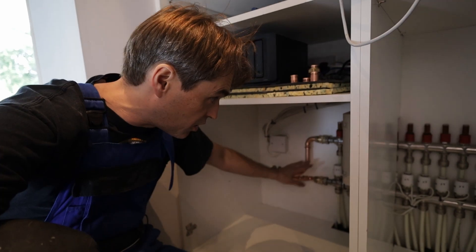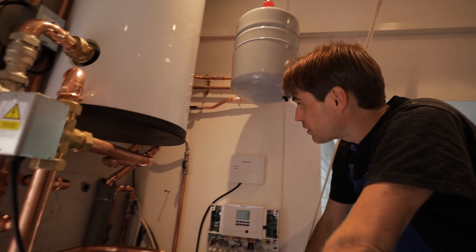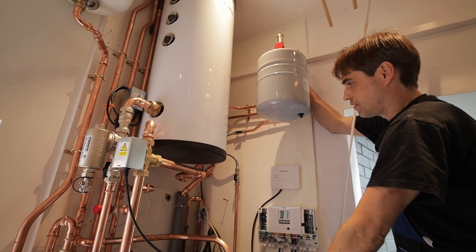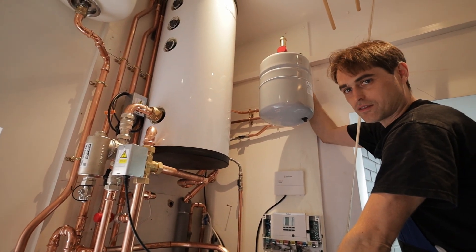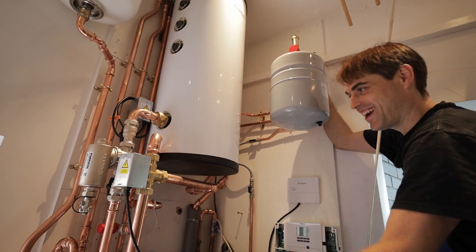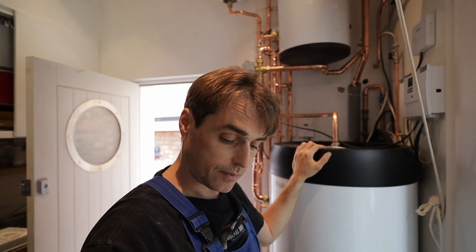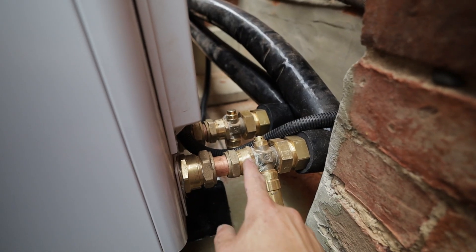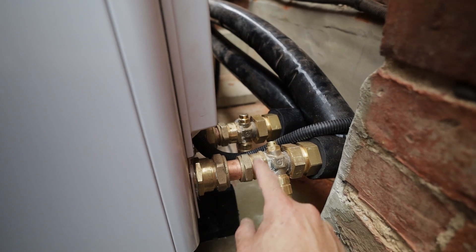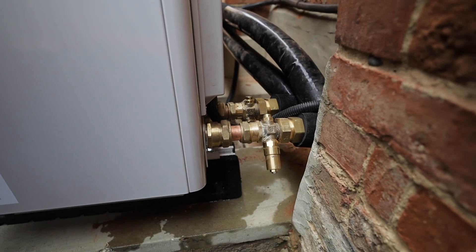Pressure testing now — we already had a couple of leaks. Those connections are always tricky; you really want a flat-face female connection and a washer, not PTFE or anything like that. The pressure is almost one bar. But it looks like we are fine.